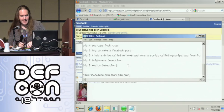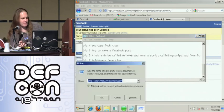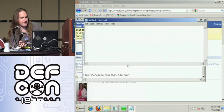All right. Essentially, the light detection just detects the amount of light in the area. I was telling you, you could trigger it by environmental conditions. This could also be like a thermistor, and you can do it via heat. But essentially, I press the button, and it says the lights seem to be on, because I'm sitting here in a fairly brightly lit section of the room. I'm going to cover the photoresistor, do it again.